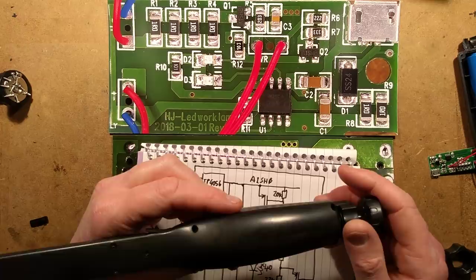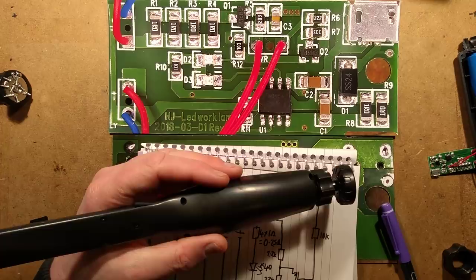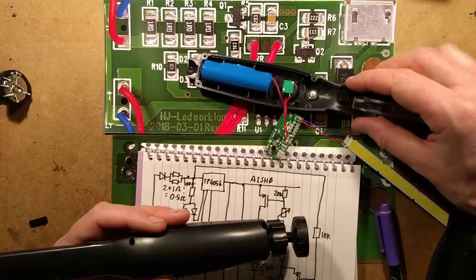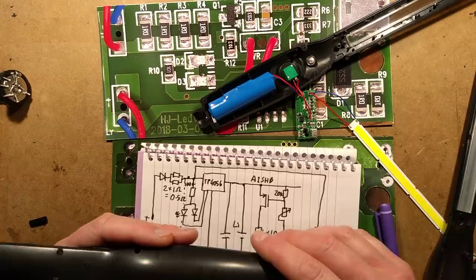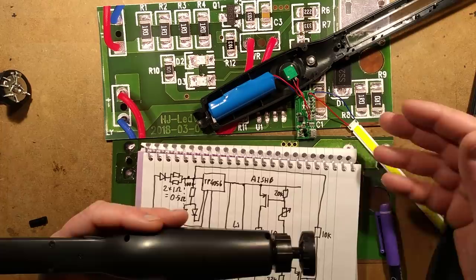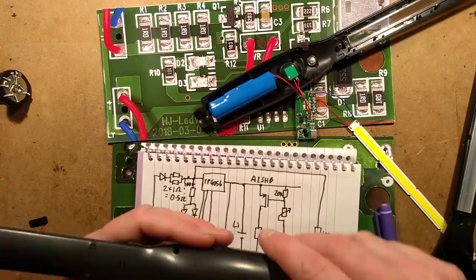The currents I measured: when charging, roughly zero to 500 milliamps; when running off the battery alone, zero to one amp. That would make a huge difference to the heat of that component and leaves plenty of charging current to keep topping up the battery. I also noticed a little circuit board under the battery — I wonder if that's a protection circuit.